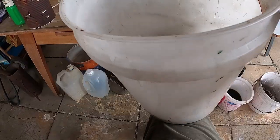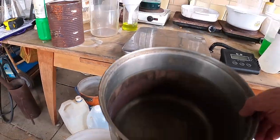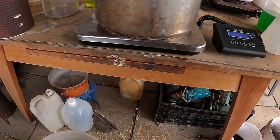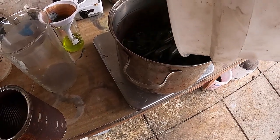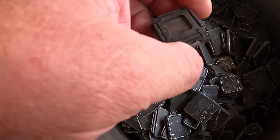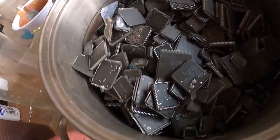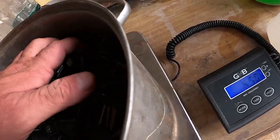Hopefully this will change. There's quite a lot here and I've got my industrial scales ready. Okay, 4.10 kilos — but I can see there's a lot of solder and even some plastic that hasn't been removed properly. I haven't been through all this, otherwise I would have noticed that. So I'm going to sort this out and put these in HCl to get off that solder before I continue. I reckon it'll be down to about four kilos once I'm done.